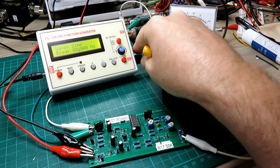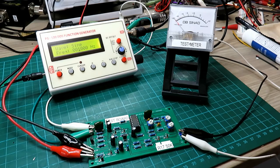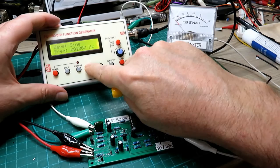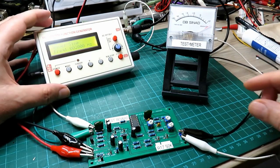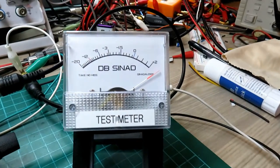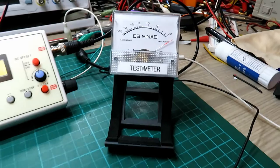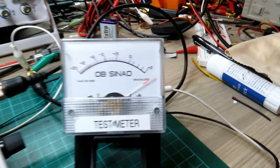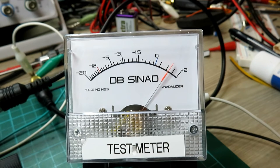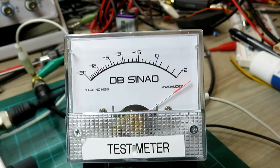We just set this as a sine wave of roughly three volt peak-to-peak output into the unit, and we want to set up a two kilohertz tone — just push the plus button like that. You'll have seen the meter go hard over to that side. The one you need to adjust first is R20 for full scale deflection. What you're looking to do with a two kilohertz signal is bring the needle all the way over till it stops, then just back it off a little bit. It might take a few goes to get it just right, then stop the signal.